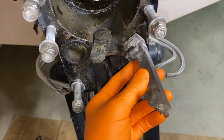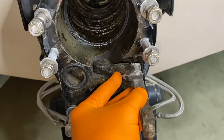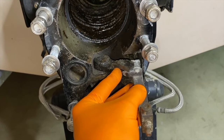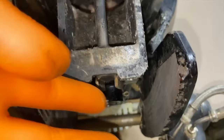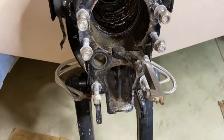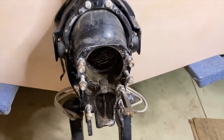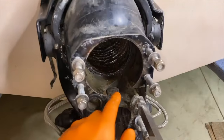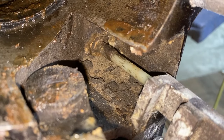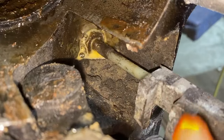Direct your attention to the shift cable slide. The way this works is that little tab on the bottom will actually slide in, and as you move the shift cable in between gears — from forward to neutral to reverse and back — it moves this entire slide and shift lever, which feeds all the way down. On the bottom side, you have the slot that the shifter, installed on your upper unit, slides back into when putting the outdrive back onto the housing. I'm going to remove this first, as well as loosen up the shift cable nut inside there, doing that now because everything is still firmly tight and secured. If I wait to do this later, after removing the hinge pins, this entire bell housing will be very loose and it might be trickier to loosen that nut. I'm going to spray that internal nut with PB Blaster and let that soak.